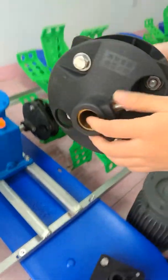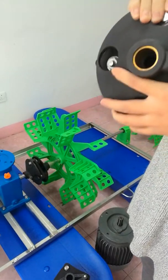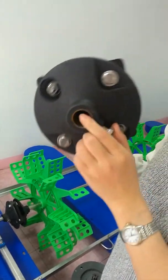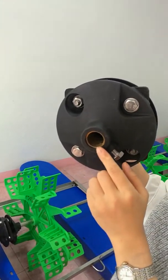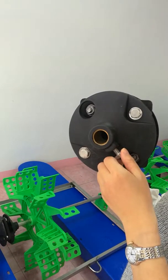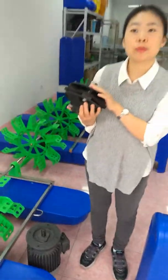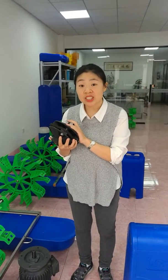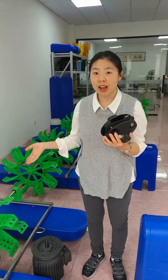So we designed a new buffer connector. Inside is rubber — strong and elastic. Outside is nylon material, and this part is not iron but pure copper, so rusting will not happen. A good connector can also reduce vibration, torque, and resistance. In this way, the aerator's lifetime can be much longer.